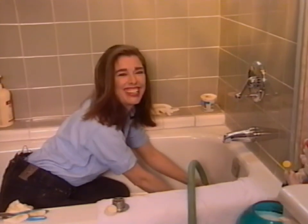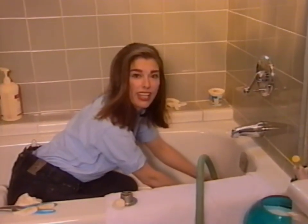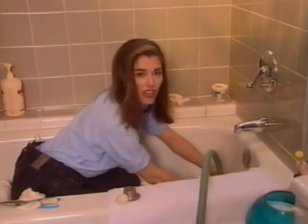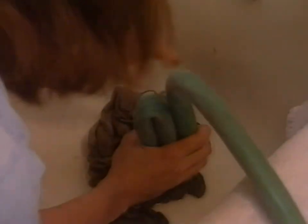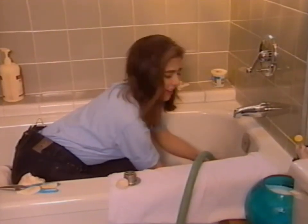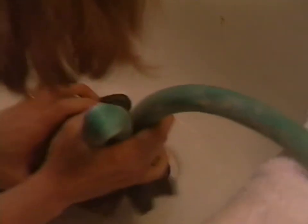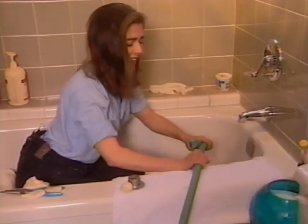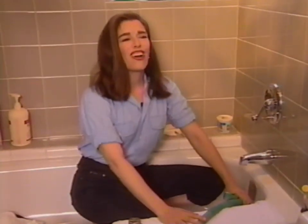All I'm going to do is suddenly straighten the hose out really fast, then kink it again like this. What that does is send a blast of water into the drain and dislodge the clog, if you're in luck. Then try it again, because it was fun the first time. I got a bit of a geyser that time, which tells me if I really did have a clog, the clog is still there. Eventually you pull things out and the clog is on its way to the lake, wherever the sewage discharges. Then remember the vital command: please turn off the water.